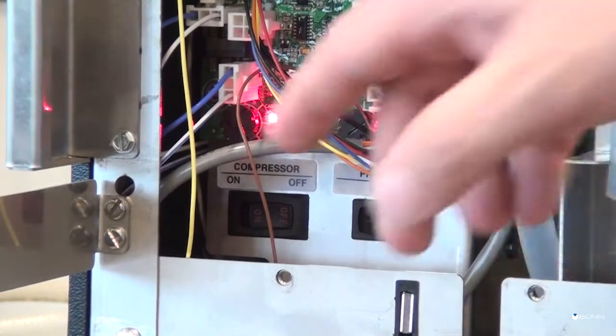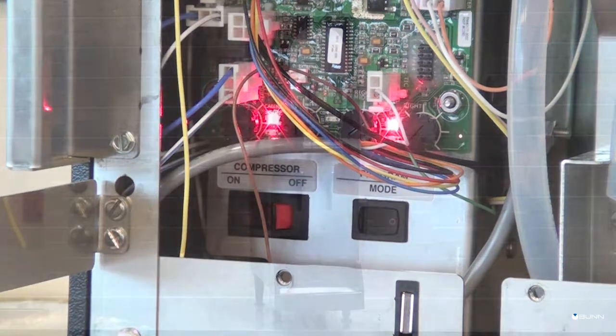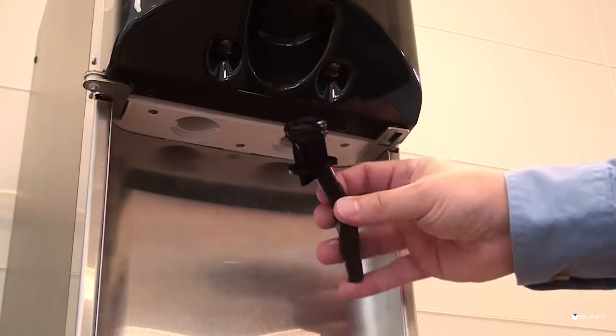Turn the water bath pump compressor switch to the on position. It will take a full 4 hours to build the ice bank required for optimal dispenser performance. During this time, some further trickling from the water bath into the drip tray is expected due to expansion caused by the ice bank formation. You should now install the dispense nozzles and drip tray.